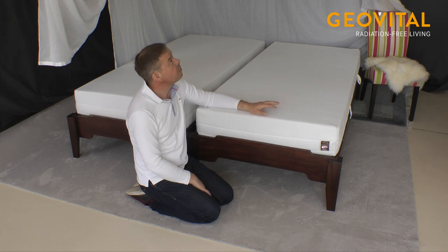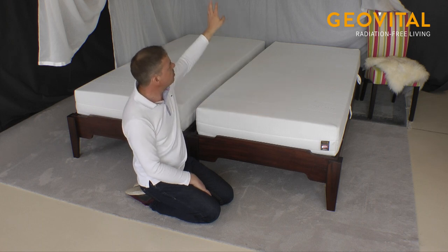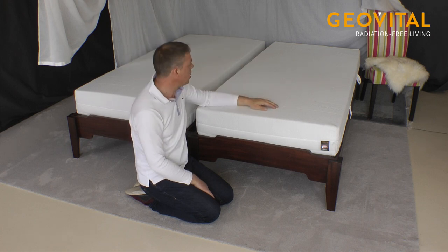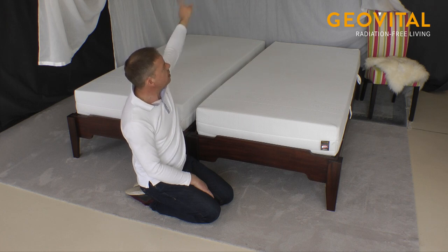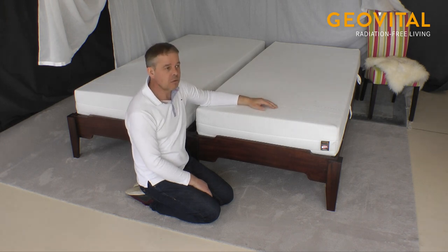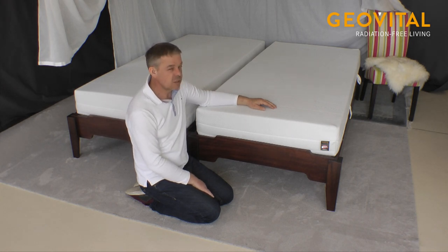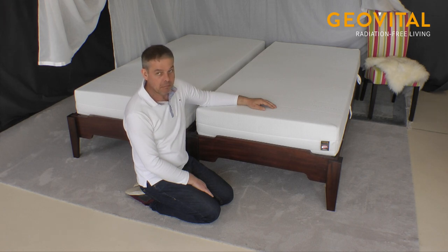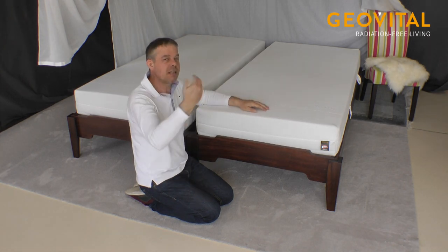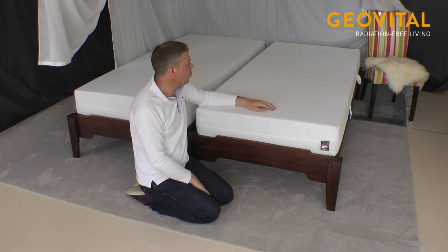The baldachin, the canopy, is there. And for example, if you also have low frequency fields at the wall at the end of the bed, it could be possible that we paint just this area, or that we use some wooden panels or Rigips panel, I don't know the word in English, which is plaster walls, yeah, which are painted on the backside and grounded. That covers the low frequency fields at the wall as well.